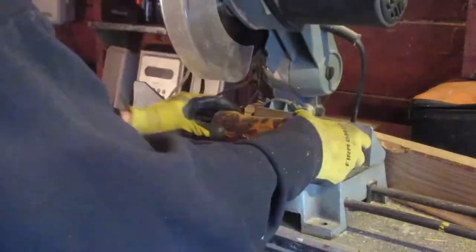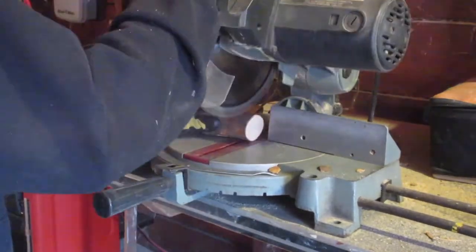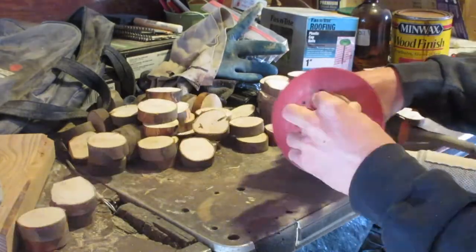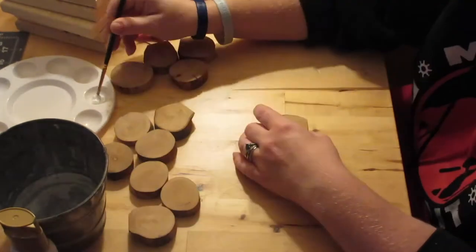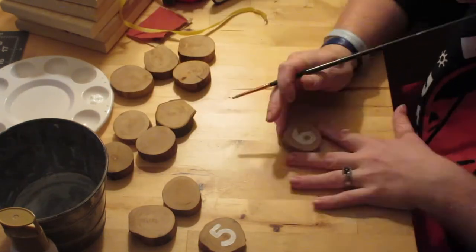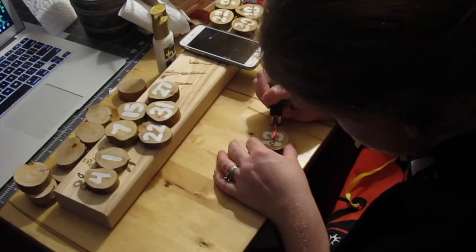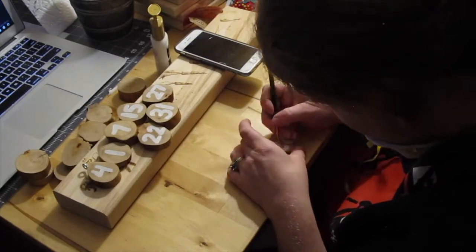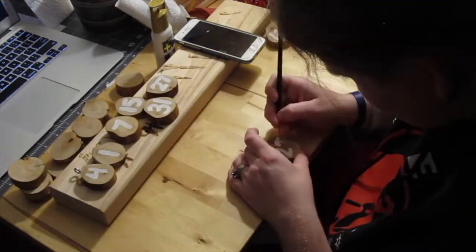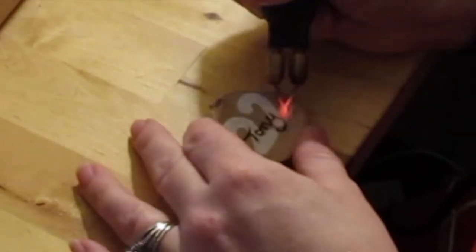Like the log, we got these branches from the neighbor and we're trying to use the resources that we have to make something cool. We let them dry out for a while and now I'm slicing them up into little pucks that we then sanded down and finished to make the individual date and name for each person on the birthday signs. The pucks served as the day and the name of those individual birthdays. I first laid down the day in white acrylic paint, then took them back and started staining the pucks so it would be a darker color to make the white pop more. Once the paint was dry, I took my wood-burning pen with the pointiest tip at the hottest heat I could tolerate and burned their name over top of the numbers. The stained wood let the white numbers pop out and the burned-in names popped out even more on top of that — a very nice contrast so you were able to read both.